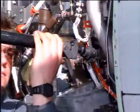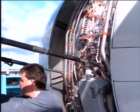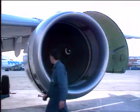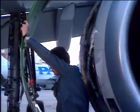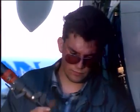The 2 hold-open rods must be unlocked to open the fan cowl door. Open the fan cowl door sufficiently to extend the hold-open rods. Manually check the correct engagement of the hold-open rods. Open the second fan cowl door. The other fan cowl door is opened in the same way. Each time, check that the locking devices are properly engaged on the hold-open rods.